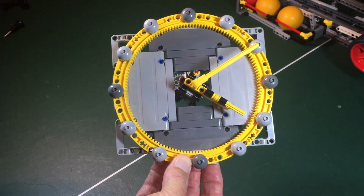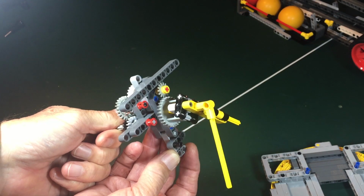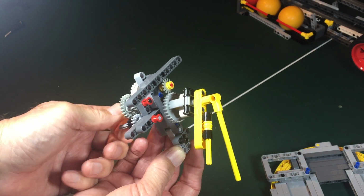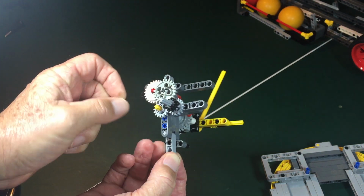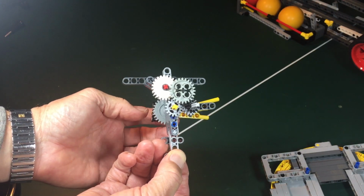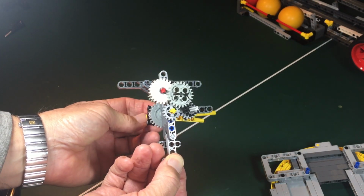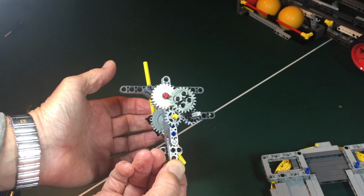I'm quite pleased with this part of the design. My solution was compact by LEGO standards and the gears couldn't be much tighter integrated. Another bonus was that the design needed an extra 1-to-1 gear to get the rotation of the hands to both go in the same direction. But that allowed me to have 2 shafts where I could bring in the drive to the clock hands. As these cogs counter-rotate, the design means you can connect to whichever shaft matches the rotation of your incoming hour wheel.